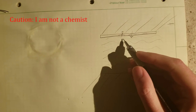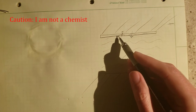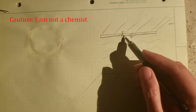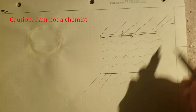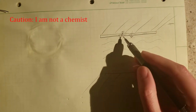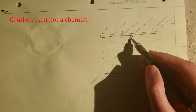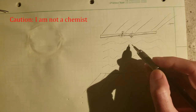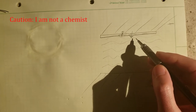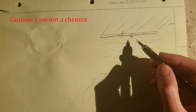create little pock marks. If we just tried to apply the rated voltage to this capacitor, what would probably happen is the thin little bits of oxide here would break down, current would flow through this thing, you'd have a huge hot spot, you'd boil the electrolyte, and the whole capacitor would explode. With reforming, we're trying to charge the capacitor up very, very slowly, forcing this reforming current through to pull oxygens out of the alkaline solution and redeposit and regrow this insulating layer, but going slow enough so that heat doesn't build up and we don't wreck the thing.